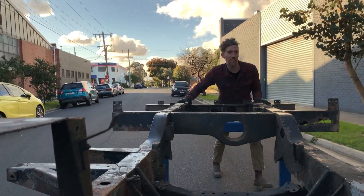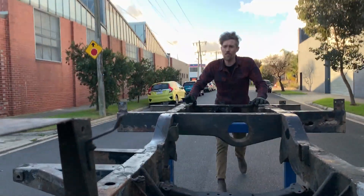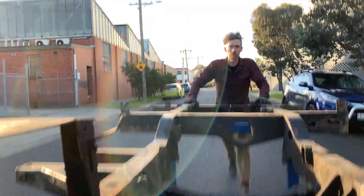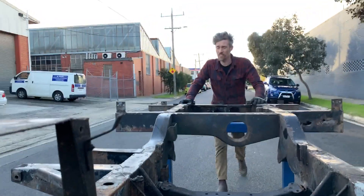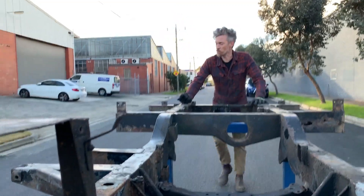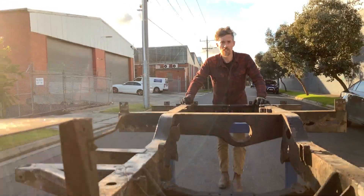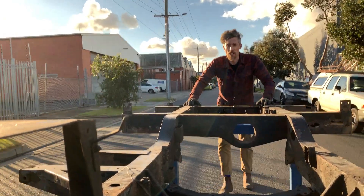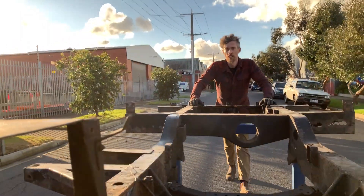I'm taking it around to the sandblaster, along with a whole bunch of other parts, to get them just pristine. We could spend a long time with a grinder or a wire wheel, pressure washing, paint stripping, all of those kinds of things, but these guys at the Blast Factory love blasting. They've got all the tools — they can blast with plastic, which means it won't affect the surface of the metal at all, you can just remove anything on the surface. So we can put even more delicate parts in there that otherwise you wouldn't want to put through sandblasting. It doesn't smooth out the texture at all; it leaves exactly the texture of the metal — it just perfectly cleans it.